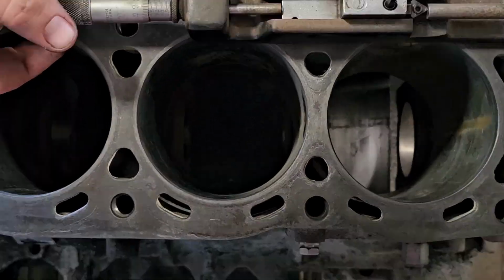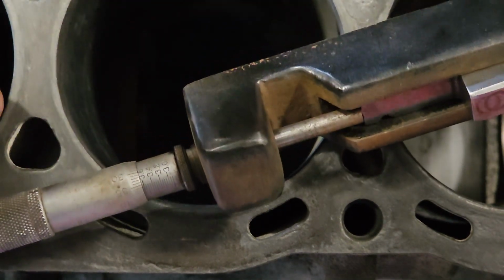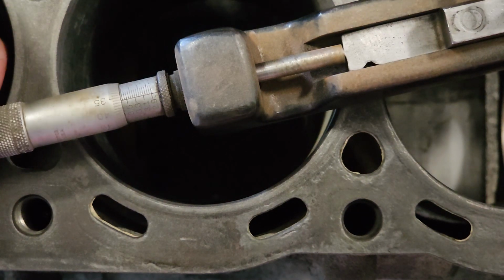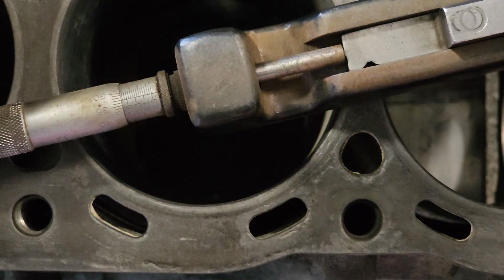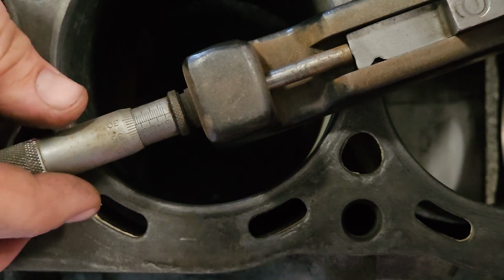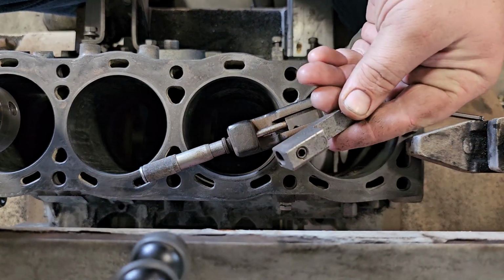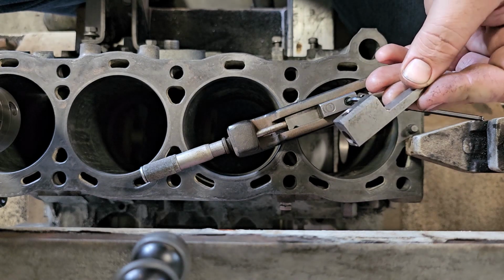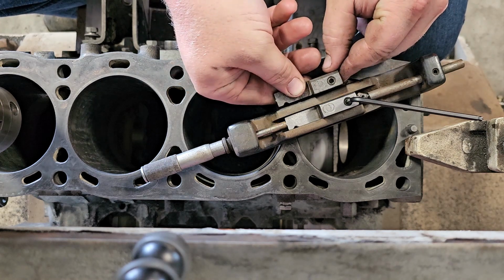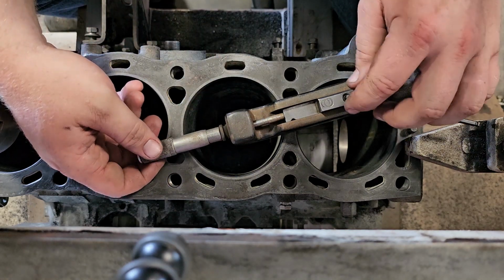Let me zoom in for you. So I'm looking on that side because that's where the 6 is. So 633. I'm just taking a standard cut just to make sure that, because first I was using this holder for a 3-inch bore, but now I'm doing a 3.5 inch bore, so I need the bigger tool holder. See, it's a little bit longer, so I put this one to the side. I'm switching to this one. I set the micrometer for that smaller one.